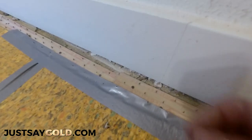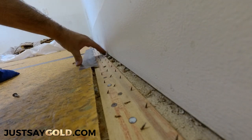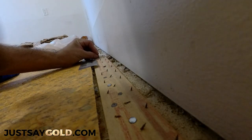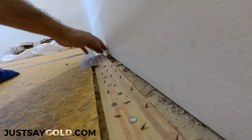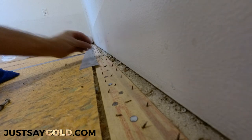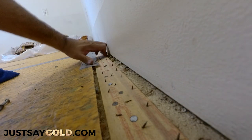So I'm going to be using a 1 inch concrete nail. It's still 10 gauge, but it's 1 inch so it's going to penetrate the concrete. I'll put links in the description for all that so you don't get confused. You can see the tackless is popping up — I'm going to show you hammering just a regular 5/8 inch 10 gauge nail. And there you can see it didn't do anything at all. This is the 1 inch 10 gauge nail, and there you see we have a very, very secure fit.